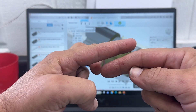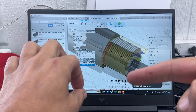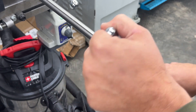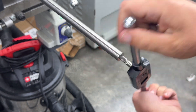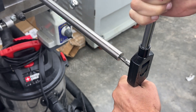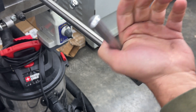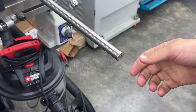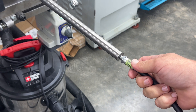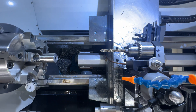When the reamer goes in and out, I'm always worried about a chip getting in between the reamer and the barrel. So if I go all the way out with it, it's just like when you're flushing it, and then the lathe will send it back in. I haven't found anything I have faith in to keep it from leaking, and pipe threads have been around a lot of years, so I think I'm just going to keep using it.